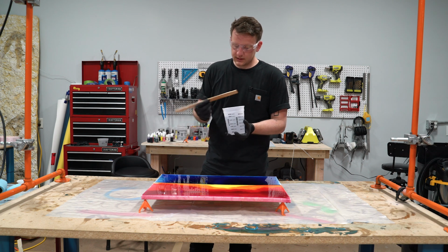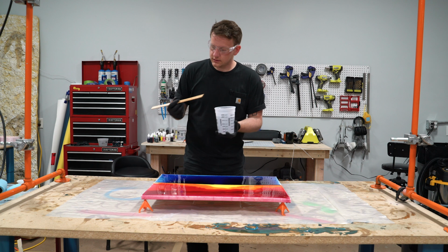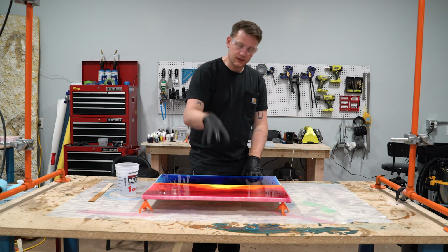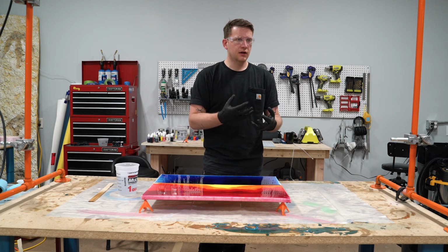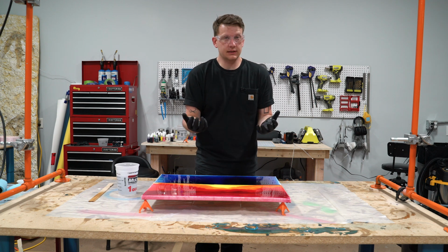All right, we are mixed up. One more time, if you haven't watched the mixing video of how to do this, check that out. We've got our epoxy mixed up, we've got our 2 sides, we're ready to go. But I wanna make sure when I'm pouring on top of this that I got a good chemical bond. Now, a real quick way to make sure that good chemical bond exists is to either pour it pretty quickly within 24 hours or even 4, 5, or 6 hours.